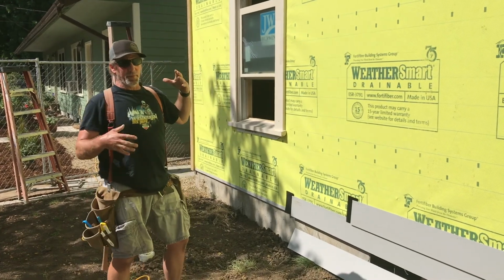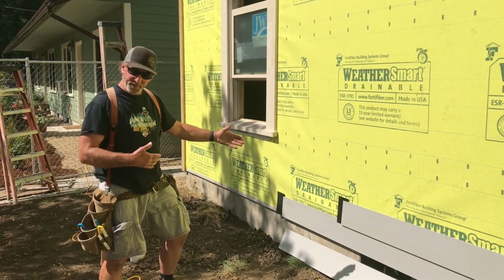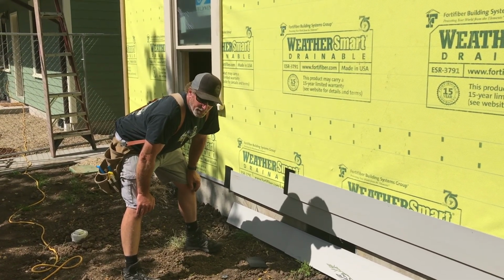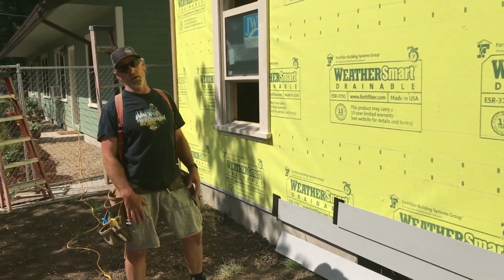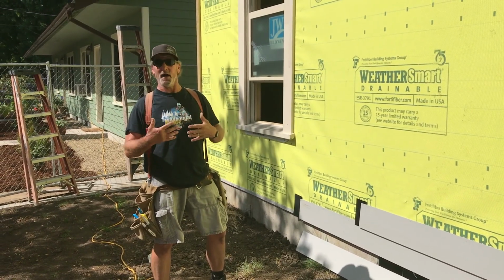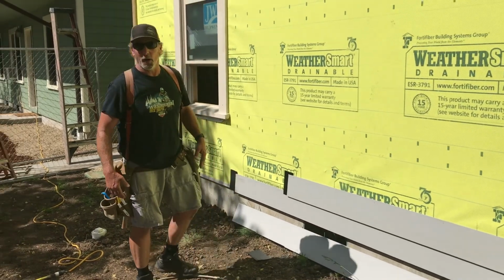Over there, we put this siding on in the winter, it was wet. We provided a little bit of gap in between the pieces, but it wasn't enough. We should have gapped it more. It's impressive when this stuff gets wet or damp, it gets longer, it expands. When it expands, if it doesn't have a gap to consume, then it wants off of the wall. What happens is it bows. It creates a big old bow where it's not tight to the wall.